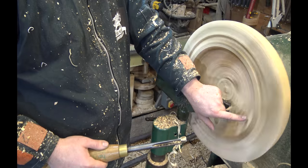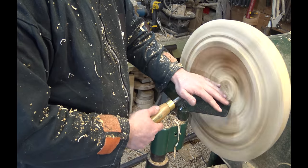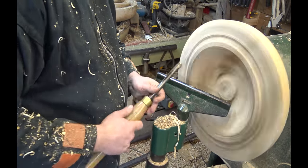I'm looking at the side of the bowl to see what my profile is — even if I can't directly see the tool cutter, I always leave a little bit visible so I can still see what I'm cutting by looking at that side with my eye.